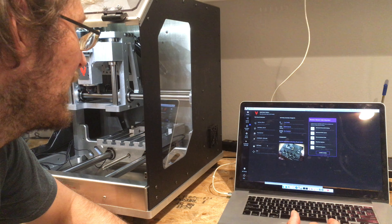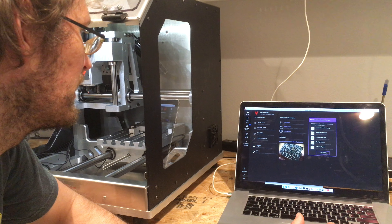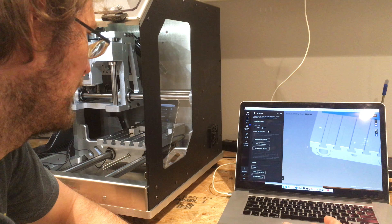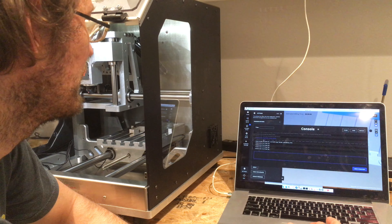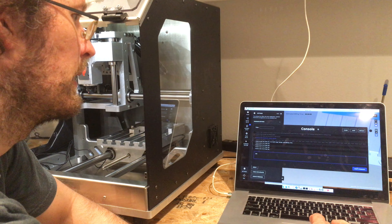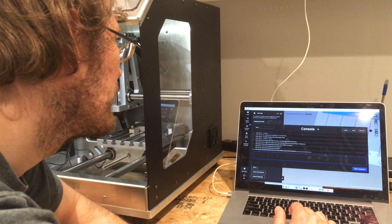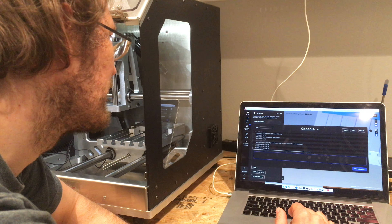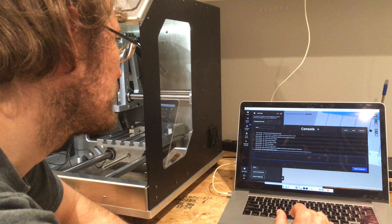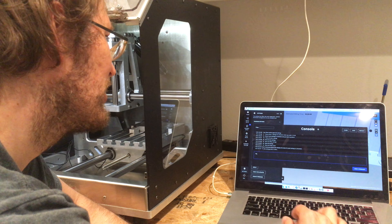I don't see anywhere where I can type in commands manually. The settings button doesn't always work. Looking at the debug console — can I type commands in here like 'home'? Token value — okay, I can see all the stuff we're sending. Show motor settings, dollar-sign one. This is definitely a GRBL-esque thing. Enter does not send the command.